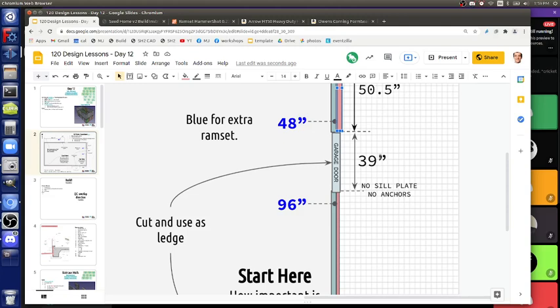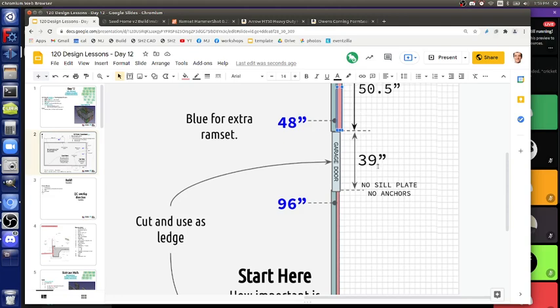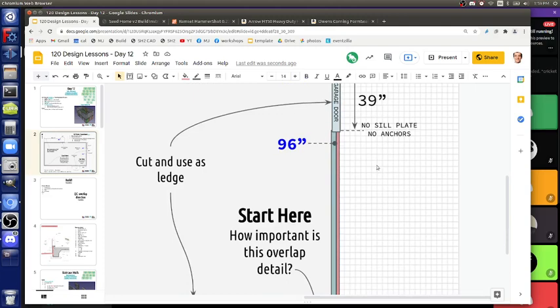The door module we built, remember, it has the two legs. The legs sit on top of the sill plate. And the door actually hangs down from that module just a little bit, so you close up the gap, that 1.5 inch of gap there. Right, the one that's set a little bit lower than the two pillars. Yeah, then the sill plates, yeah, then the pillars. The door actually hangs down from the door modules that we pre-framed. It goes down below the frame so that it can close the gap that's below the door here.